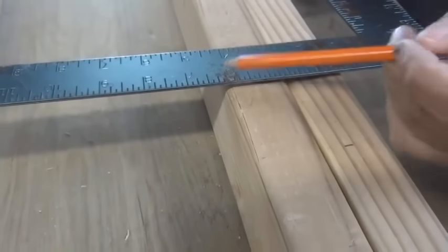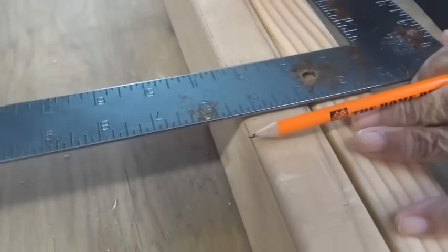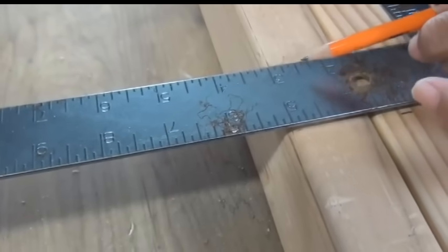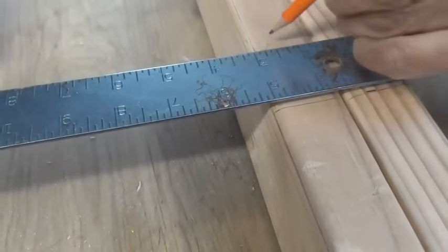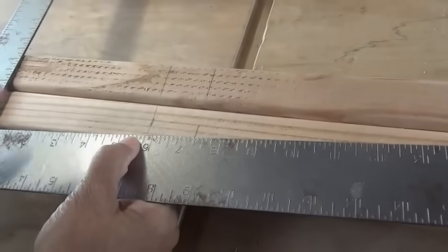So this is where the cool tool — the tongue — comes in to speeding up the framing layout process. We've got that hash mark there, that one hash mark, and we know that our framing square is exactly the thickness of a stud. So I'm going to strike a line here and a line here, and I'm able to mark my layout very quickly.